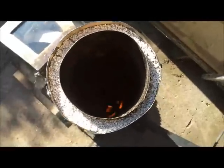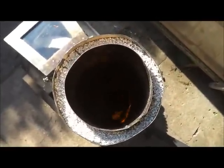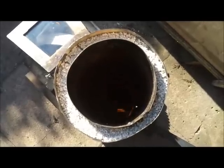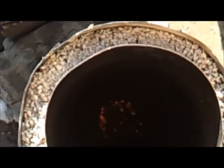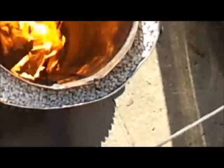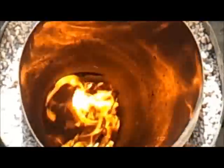I'm going to try taking off the bottom bit of insulation under that air hole and see if any difference is made when it starts to pull air from the bottom. I'm going to drop some sticks into the riser tube. I've got a little gizmo down there to control extra oxygen. Believe me it gets hotter - you can instantly feel the updraft. You can feel the heat decrease when you close it.